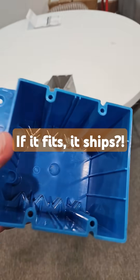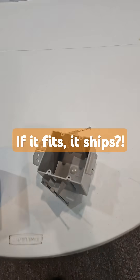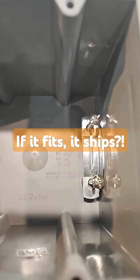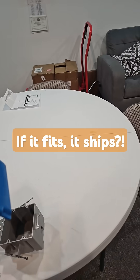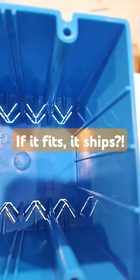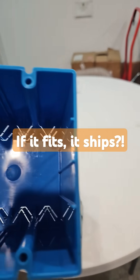Everybody's favorite topic — box fill and listing. We do a lot of EV NEMA 14-50 plugs. If you do the box fill calculations, you know you need a big box. With a NEMA 14-50 and 6s, you need like a 38 cubic inch or something.